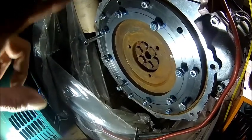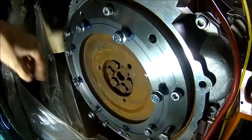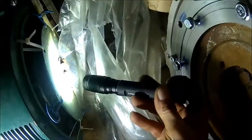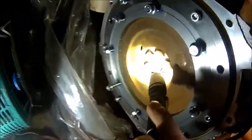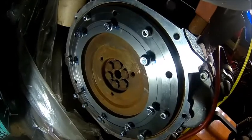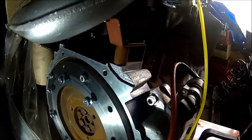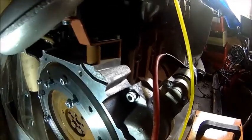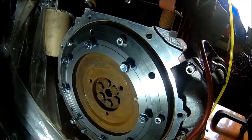So what we're going to try now — I think I said it before, but the reason for that ring is these bolts here, these ones are sticking out. So they would foul on the flywheel bolts — that's another reason why we need that ring. Also, SRI flywheels look a bit different; they got all these features machined into the flywheel and it will be further back. But this is a pretty thick flywheel, probably for a hydraulic combo.